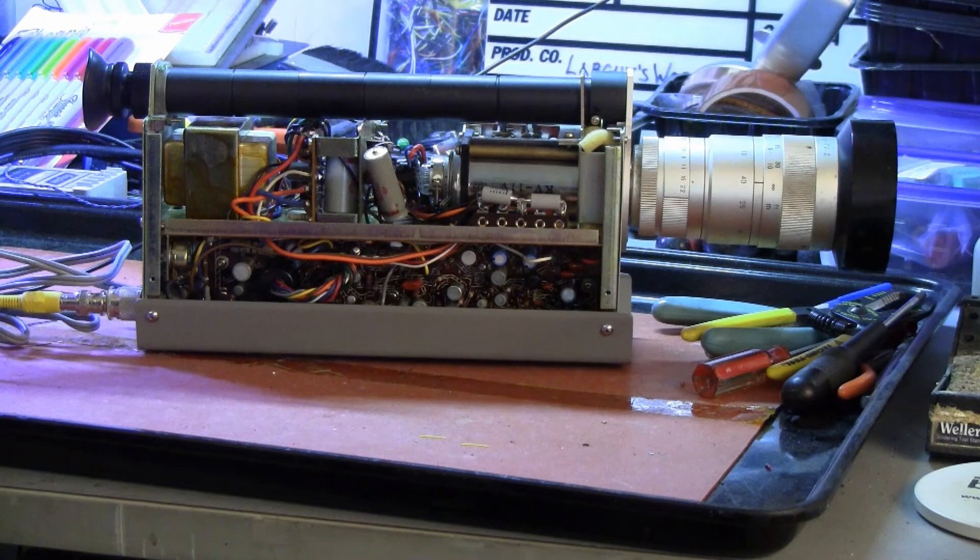Here's the Craig 6104 on the workbench, connected to my Sony broadcast LCD monitor and power. I've reassembled it for this test. I ordered two Vidicon tubes from eBay, but when they arrived both had gone to atmosphere — both were bad. The seller has been very cooperative and is sending me a couple more Vidicons, hopefully intact. Out of curiosity, I haven't replaced any components; I have the dud Vidicon in there — the heater opened up when powered, so there's no heater glow in the tube.